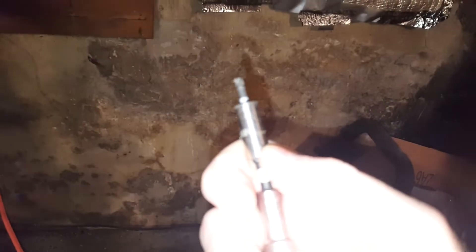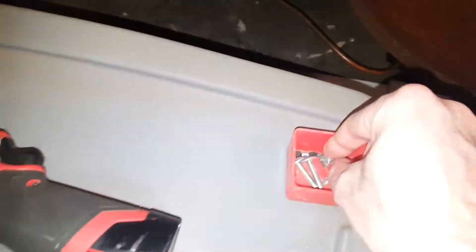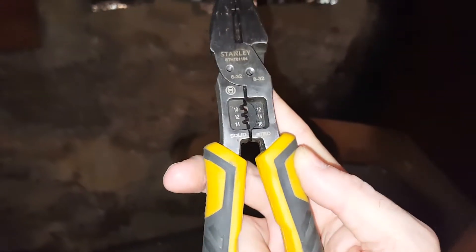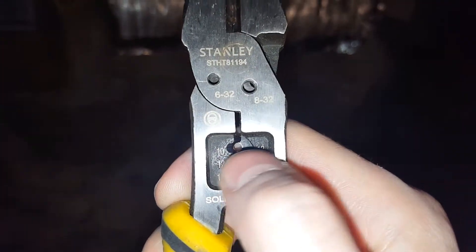Other tools: I have a Robertson bit number two and a screwdriver. That can also go into a power drill, and you can see the number two bit goes perfectly into a lot of the screws used in these electrical panels. You can also use a flat, but the Robertson is perfect. I use my Stanley wire strippers — it's got the 10 gauge there for solid, so I know to put it right in the top.